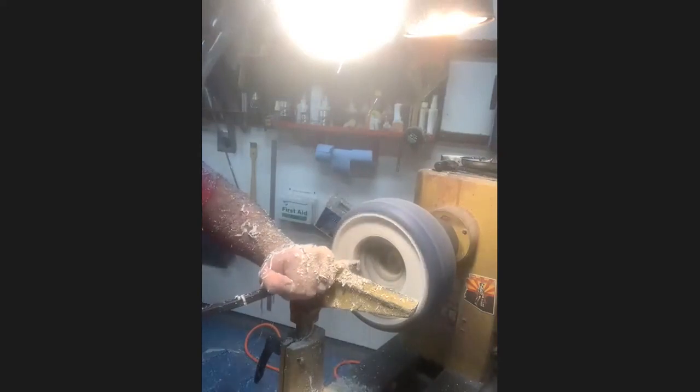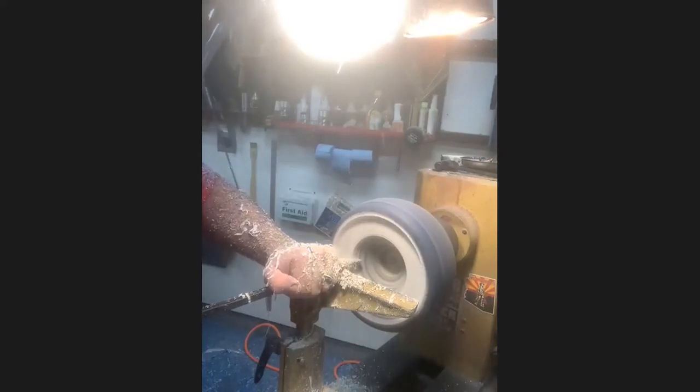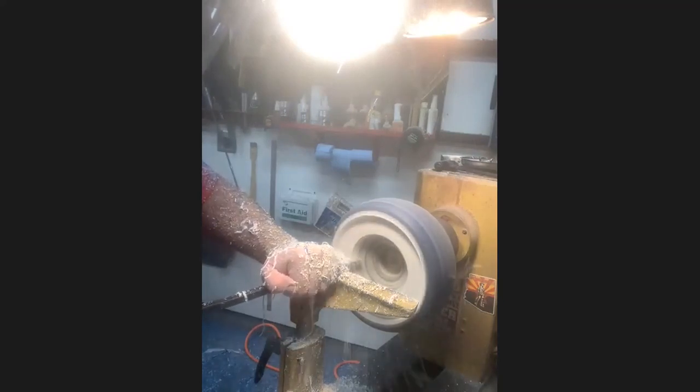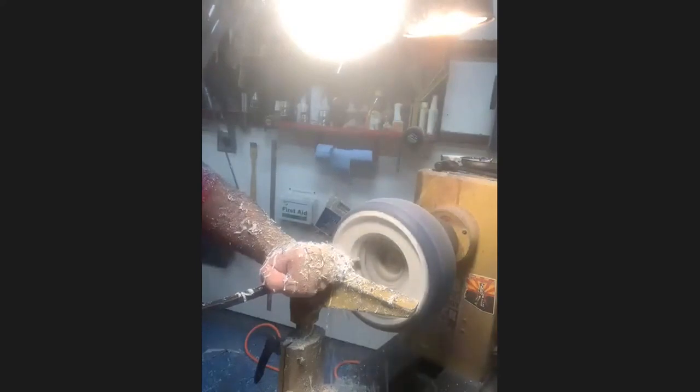But if you're using a ball end cutter, I don't think you can go in reverse with it. And there's some other tools that won't work. Either way, please start at a slow speed before you give that a whirl. With the ball end mill, Eddie, the flutes are the wrong way. You're right. Yeah, it won't work.